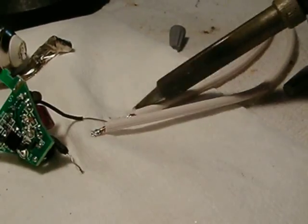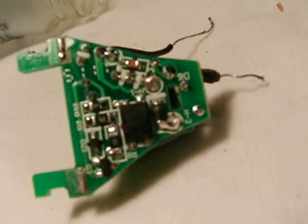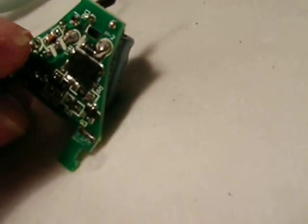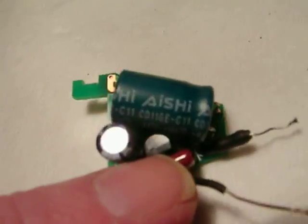The rest of the power supply is a simple timer circuit. When you first power the bulb up, there's a small diode right off the power supply - a little barrel diode. It goes to a simple timer circuit comprised of surface mount resistors, a transistor, and then this little thing that looks like a transistor but it's not - it's an SCR, especially designed for switching high current loads.